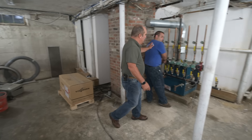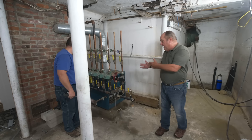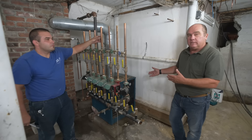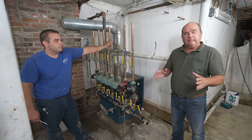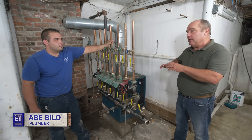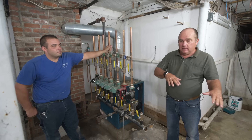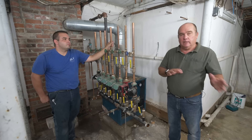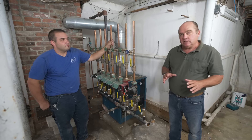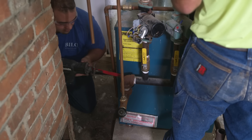Hey Abe, hey Richard. When they did the first inspection they found a 30-year-old cast iron boiler in reasonable condition and thought maybe they'd leave it. But there's been mission creep — they're tying onto some old cast iron baseboard but also adding radiant, radiant for tile, and another indirect heater. With so many changes, maybe it's the right time to replace it. Ready to go? Time to go.